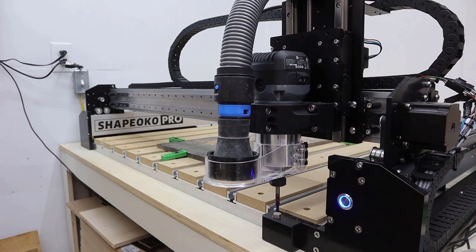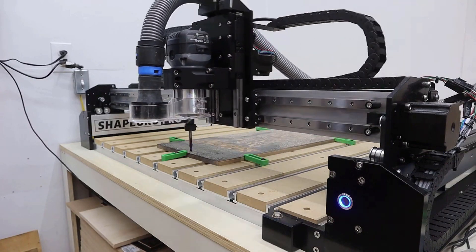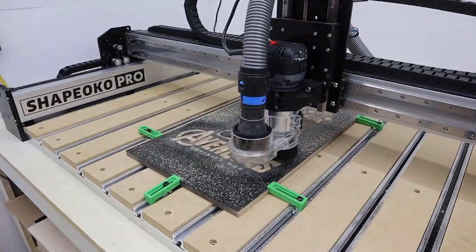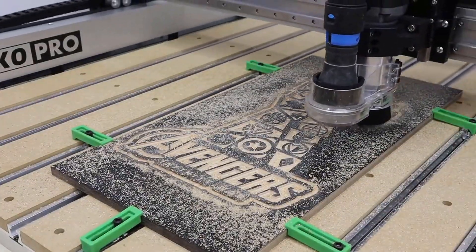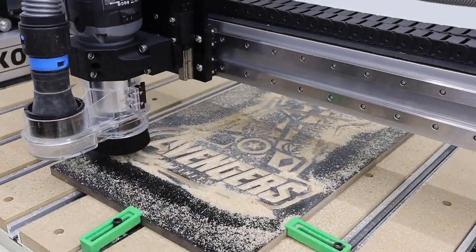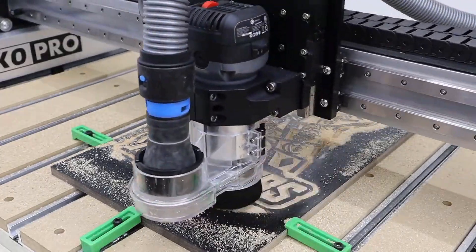The place where a Bit Setter really shines is in tool changes — in a job where you have to change tools. What it does is allow you to change your tool and not be finicky on the exact placement up and down within the router or spindle. You're able to re-probe the end of the bit, and the machine knows exactly where that point is to continue. This allows you to get very seamless transitions between roughing passes and carving passes, and dead-on accuracy on depths of cut.